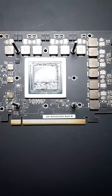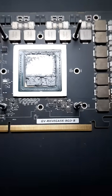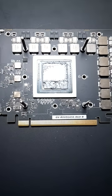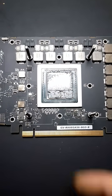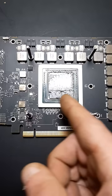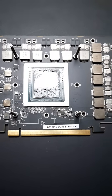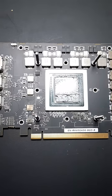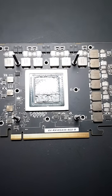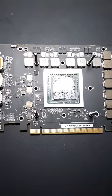Alright, how's it going everyone? In this video we got the RX Vega 56 8GB card. It has HBM2 memory and these two chips right here don't seem to make the best contact with my water block, but they stay fairly cool anyways. This card is a Gigabyte model, just an air blower style card — pretty basic — and I'll show you the quick mods I've done on it for the country cup.